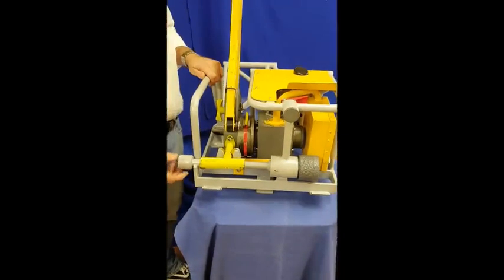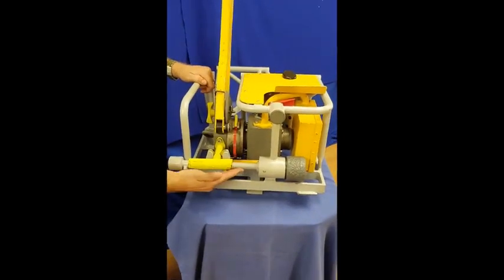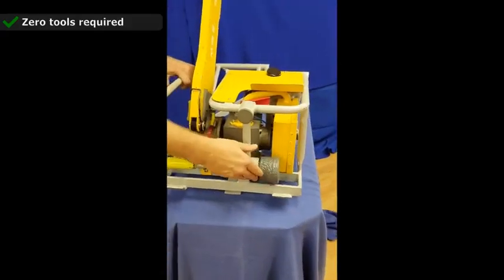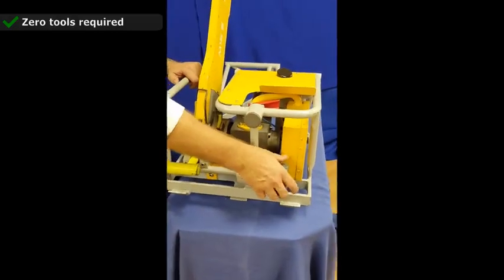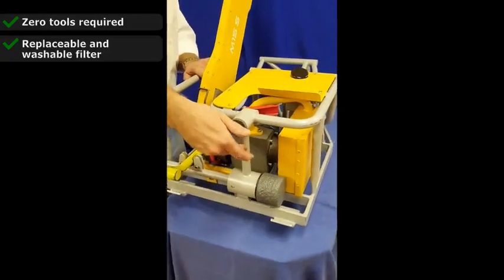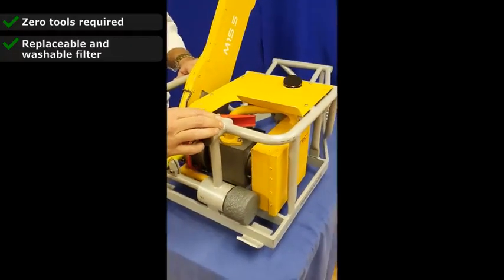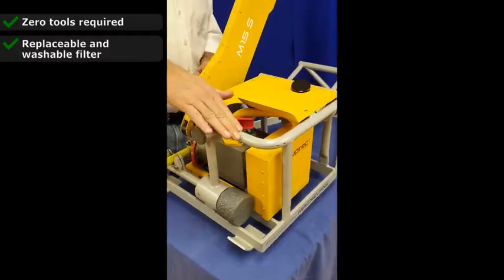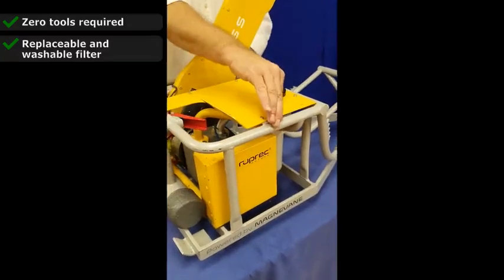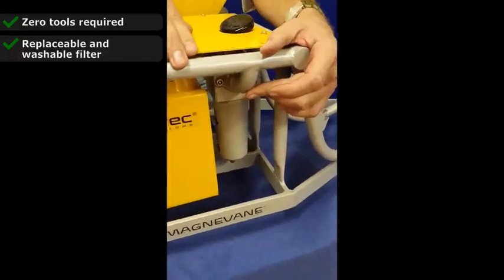Basically starting with a 1-inch female BSP welded socket inlet, moving on through a seamless pipe into a 1/2-inch toolless required steel pleated replaceable cartridge filter, which is washable and long lasting. Still moving up through a 19mm rigid pipe into a 3/4-inch spring loaded poppet style trigger system. Moving along in a seamless 19mm still within the frame. Down into a 1/2-inch inline lubricator system.